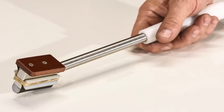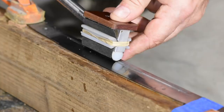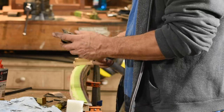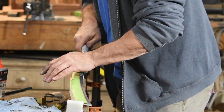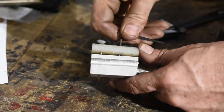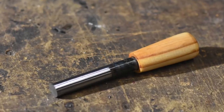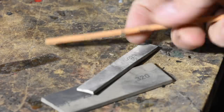The second tool is a sanding device. Unlike the cutter, this one is totally my design. It consists of a body, a handle, and a form. A long strip of sandpaper is stretched over the form so that you can keep feeding in fresh sandpaper as it wears out. Like the scraper, you can replace the form so you can use the tool for various groove radiuses. In this case, I'll be using a half-inch diameter form to match the half-inch diameter cutter. I'll also be using some other tools, including some homemade scrapers, some riffler files, EDM stones, and some other stuff.